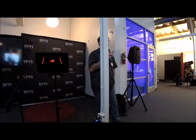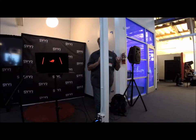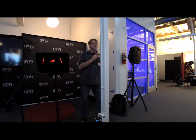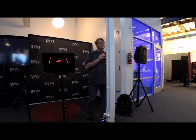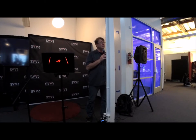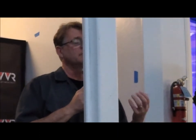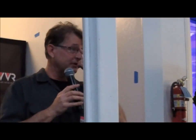Are you using motors or electromagnetic brakes? We're using servo motors with a custom control board that we've written software to talk to. The torque on the pedals is pretty impressive. For the steering, we still have some work to do. The electromagnetic brake idea — you know, it'll stop things but they're not as strong as you'd think without gearboxes. Ours has a 10-to-one gearbox on it, which makes it much stronger.